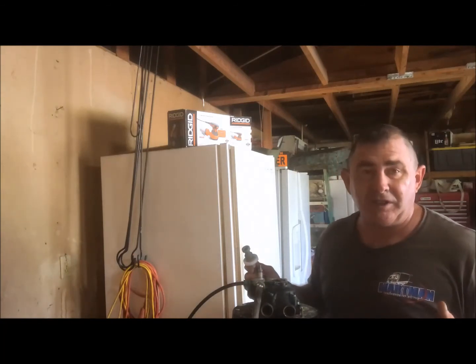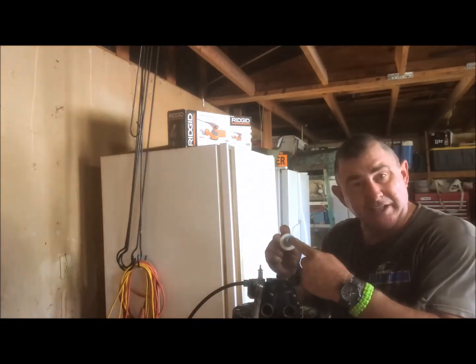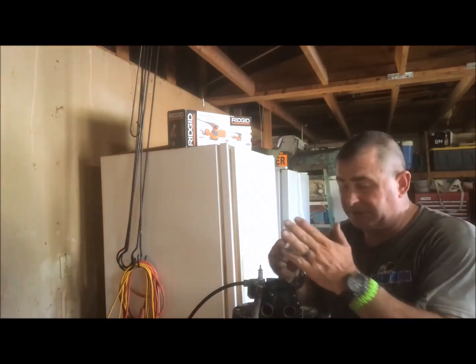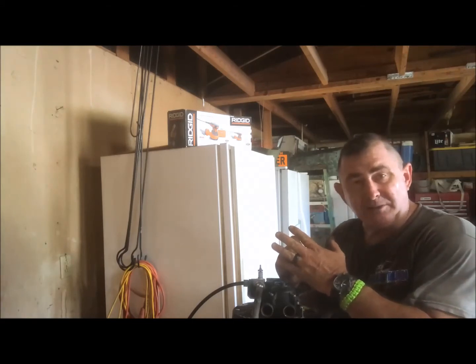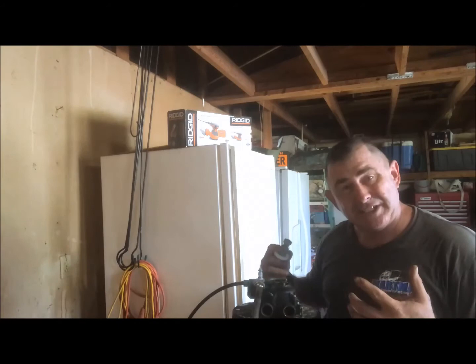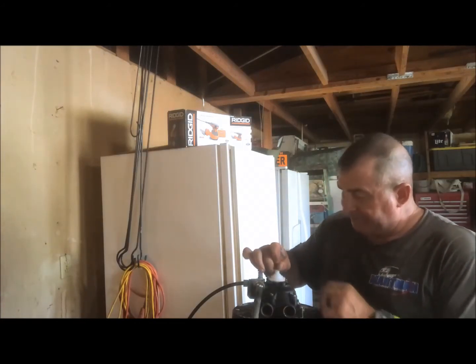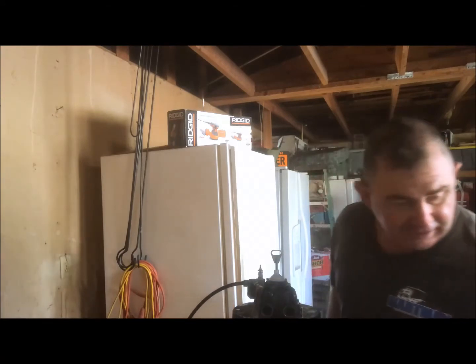It's just a matter of backwash gallons per minute. So this allows for less gallons per minute, and a filter, because that plug's there, gets more gallons per minute, because a filter has to lift the whole bed and push everything out, where a water softener does the same thing, but it's not as critical as it is for a water filter. So then we just press that down there.